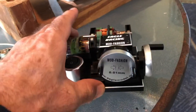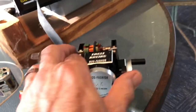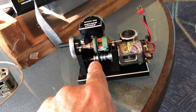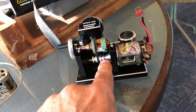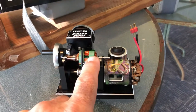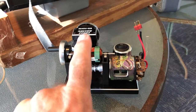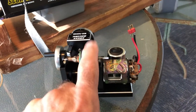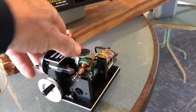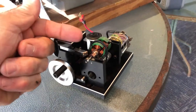When you apply power and turn the switch on, that'll activate this motor here, which will be spinning this pulley. Depending on the type of armature you have, you'll put the belt in the position necessary so it won't be rubbing up against your windings — it'll be on the actual armature itself. It'll spin the armature at a set speed, and what this has here is a diamond cut blade and a knob to bring the blade in and out.